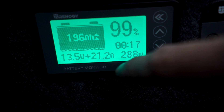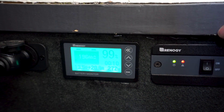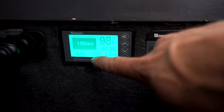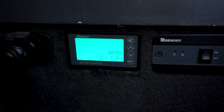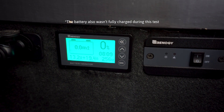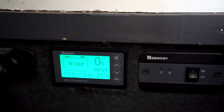I'm going to go ahead and turn on my water heater and see how the battery handles the discharge. Let's turn on the inverter. You can see that's dropping down and pulling about 116 amps from that battery. This is probably a bit above what the battery is capable of handling. We're at about 11 volts — I'm assuming that this is going to shut off pretty soon. The battery just shut off. So overcurrent protection does work. The battery did work well for a bit, but that was too much for it to handle, and it did shut off, which was a good test for the BMS.